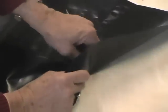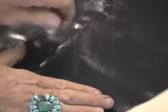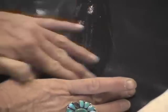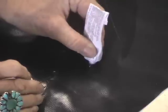On floors — people ask me about gouges and floors. Every once in a while, especially after you've been using the boat for a few years, you can get some deep gouges. What you want to do with these is ideally AquaSeal, and if you don't have AquaSeal, seam grip also works really well. You do not need to put a patch over this. You're going to wipe that area down with the alcohol pad, let it dry, then put a really thin bit of AquaSeal in.